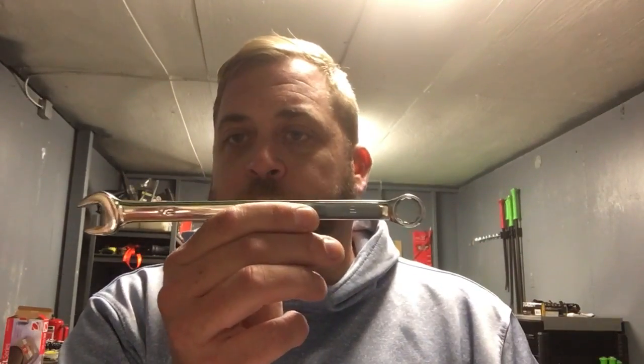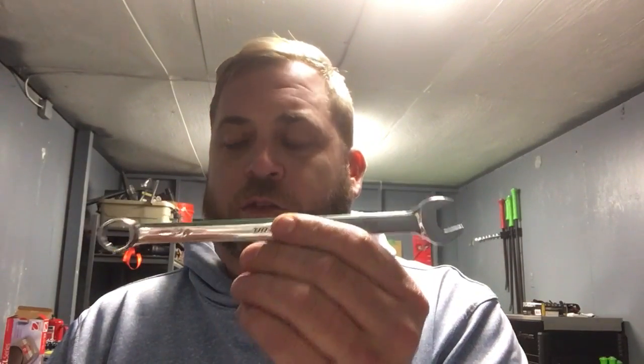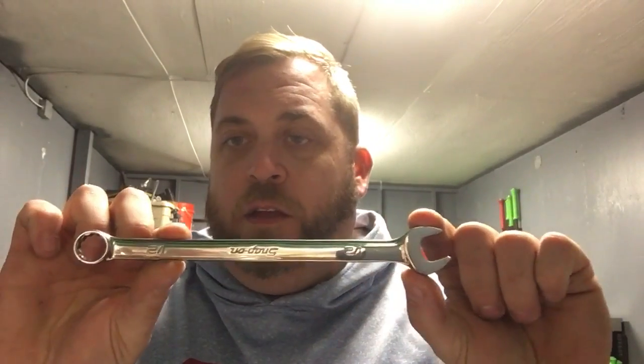So the first wrench is just a Snap-on regular 8-inch wrench. This is their standard wrench, so some of these wrenches come in different sizes, and we'll get into that. It's the non-flank drive one. This one weighs 85 grams. The fastener opening is 503 thousandths. The head thickness is 266 thousandths, and the head width is 1 inch 32 thousandths.